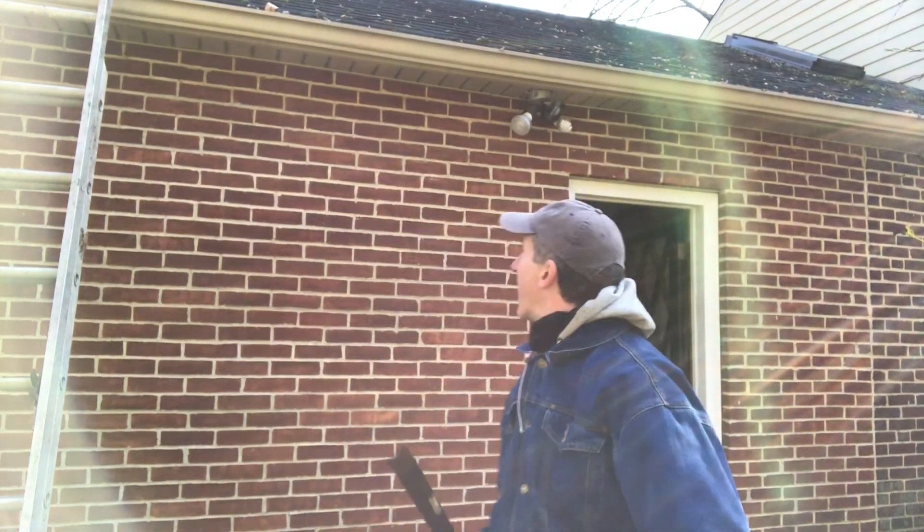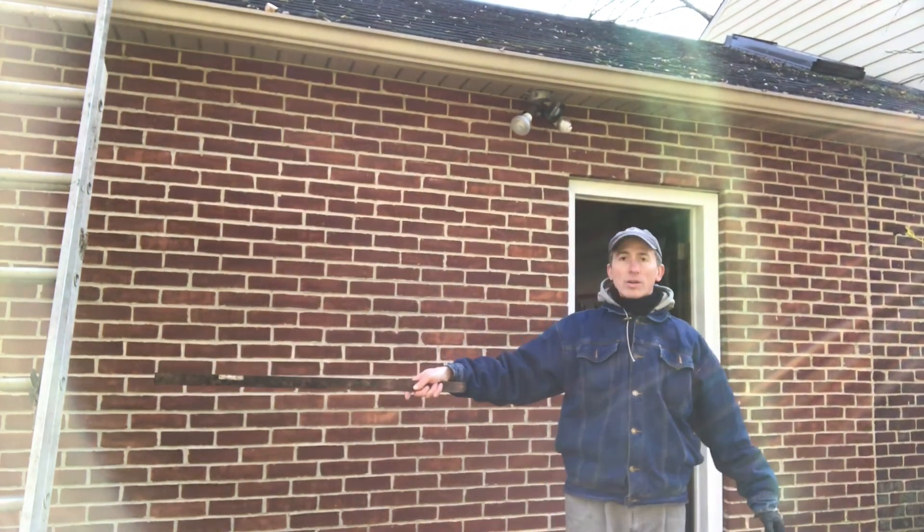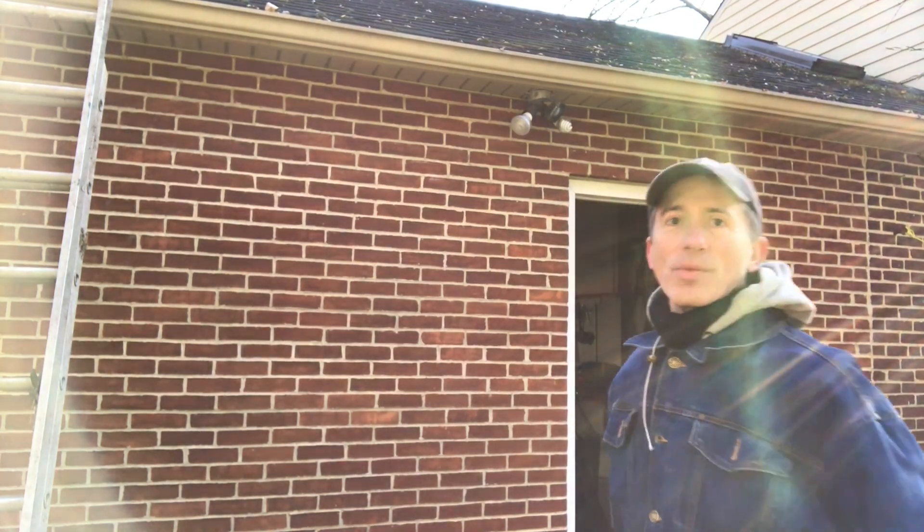Now I'm working on the garage of my house — this is just a one-story gutter. As you can see, I have a smaller ladder out now. I left some leaves right about there and I was able to push that leaf to the edge of the gutter — that's where I need to start the next time I move the ladder. The way I know where to put the ladder is I take this stick and find that spot, and I know how much room I have to move the ladder. That's just an easy way to know how far down you move the ladder. When you're using the big gigantic ladder and moving it around, you want to move it as little as possible, so you want to know exactly where to put it for your next stop on cleaning the gutter.